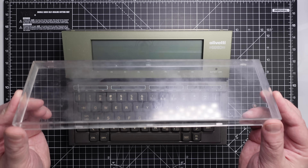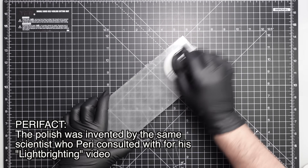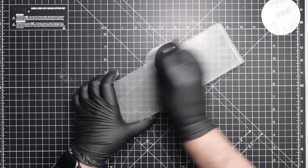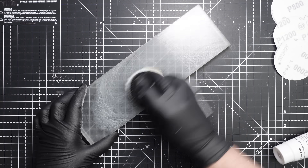As you can see, the glass was damaged because when I was a kid I tried to clean it with acetone, which actually corroded the surface and damaged it. Let's try to fix that with a polisher which is usually used for the headlights of cars. I don't know if it's going to work, so be careful and don't try this at home if you are not sure. First I had to use three levels of sandpaper strength, and then I used a wool polishing pad for as long as necessary until it was shiny.